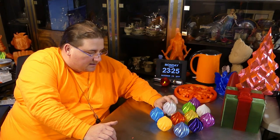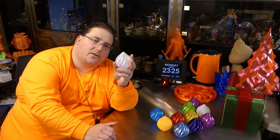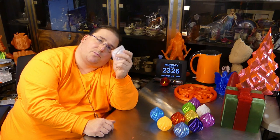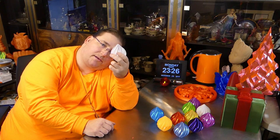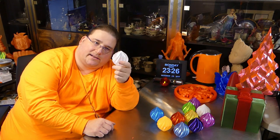This is from ReFilament — it is a recycled PET filament and it is beautiful. This is nylon. I actually got printing with nylon, but I ran into one small problem: brittle. I discovered how to fix this already — you have to print hot. If the previous layer isn't hot enough, the filament will still flow but it won't properly bond to the previous layer.